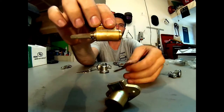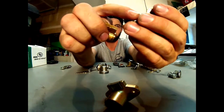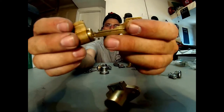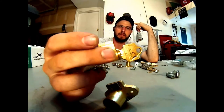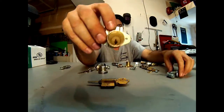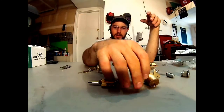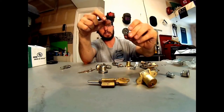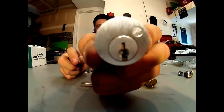This would be a cylinder that goes in a lever. It's the exact same idea where it has the pins — the pins sit in the key drop spots here into the cuts and that allows the lock to turn. Very proven setup, very reliable setup. This is going to be a whole lot better than the disc tumbler as far as security goes. There's a lot of little drawer locks like this little Olympic drawer lock. This may look similar to the wafer locks, but if you look inside, it is a pin tumbler lock.